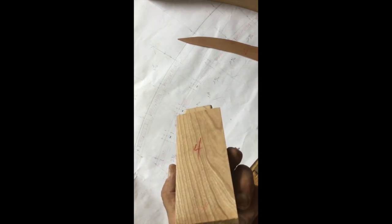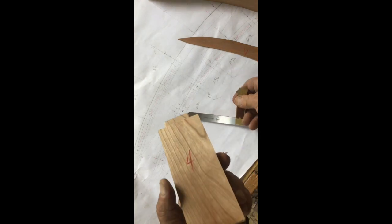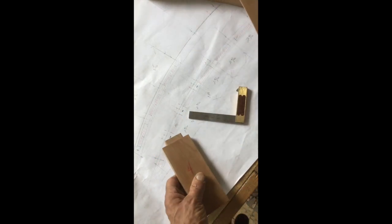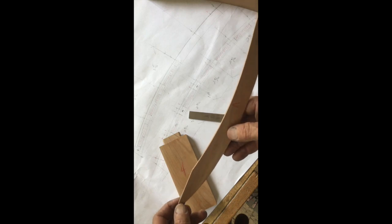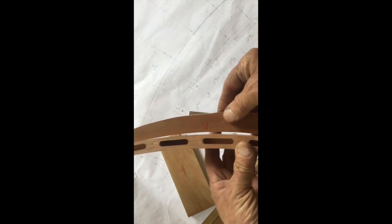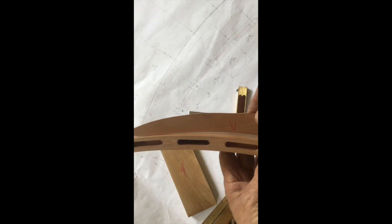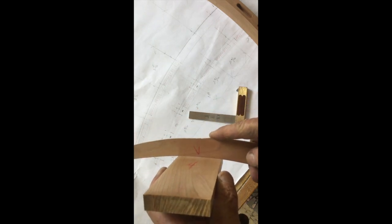So I told you I wanted to compass this particular stave. I don't know if you can see, but there's quite a bit of curve to this. And I made a pattern of that curve. And basically what I did is I ran a compass plane along the surface, could use a spoke shave, and I got a shape that I liked. Now notice that it's quite a bit more shaped than the arc of the breadboard ends. So through various means, which I'll show you, I shaped this and fit it, and I liked it.